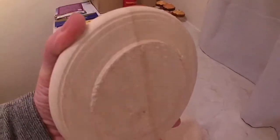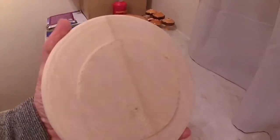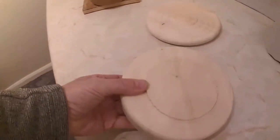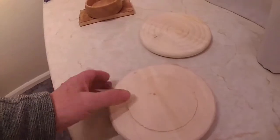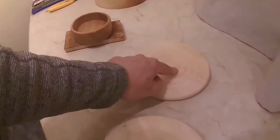I've got to sort the back out. I haven't got a proper parting tool to part this off on the lathe, so what I've done is used my bow saw and cut it in the gap I created as deep as I could go with my chisel, and then cut it with the bow saw. That'll get sanded down so it's flat — that'll be one piece. Then this will go back on the lathe and I'll turn this surface flat to start with.